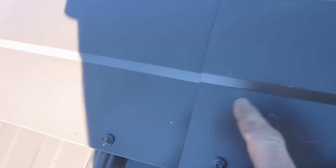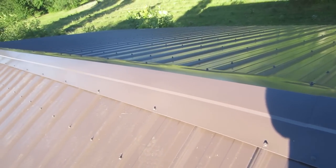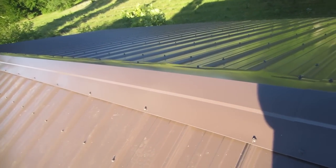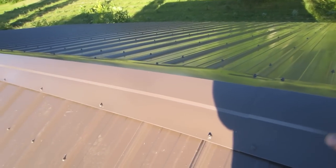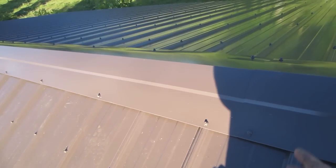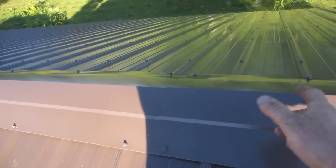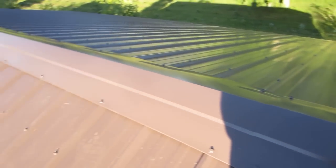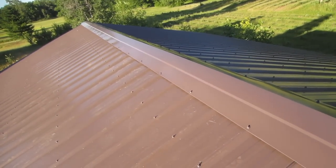So now the entire ridge is vented. If you do have ten-foot sections of ridge vent, make sure that you center those vents on the roof and split the difference on the end with ridge cap. It looks goofy if you've got a 44-foot building with, say, two ten-foot vents that aren't spaced equally and then a four-foot gap at one end or the other — looks kind of silly.